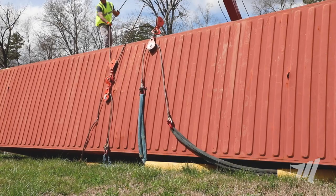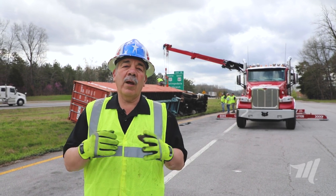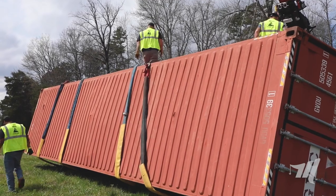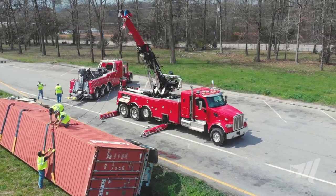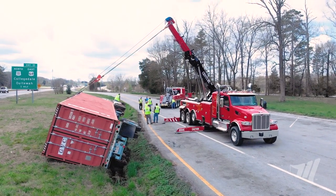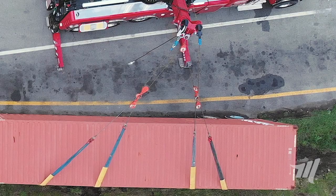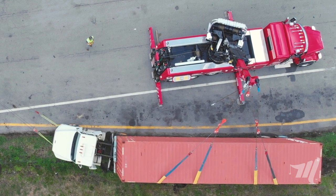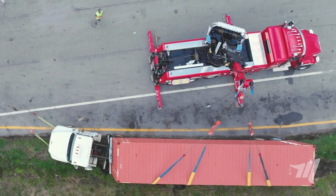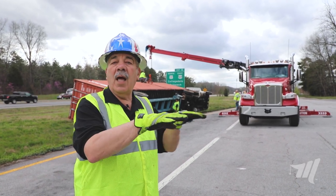If you want to pay attention to what we're doing, we're taking the boom cables and going to four straps. Many of you think using four winches to four straps is the right way of doing it. We're taking four straps, run underneath it, and we're going to use our traveling snatch blocks. We're not lifting because it's outside of the 20-degree cone. Anything inside a 20-degree cone of the wire rope is considered lifting. Anything outside is a pick and pull. So we didn't set blocking underneath the outrigger legs. We're using one winch line and a four-part line — once we upright it, we winch it out with the 90-55 in front. The rotator boom is going to rotate but shift within itself to keep line tension on all four straps even. When you use four winch lines to four straps, I don't care who's running the truck, line tension is not the same.